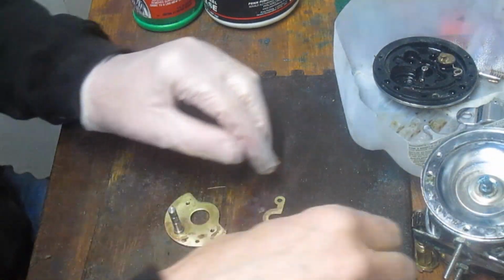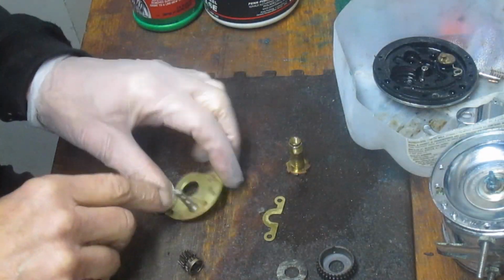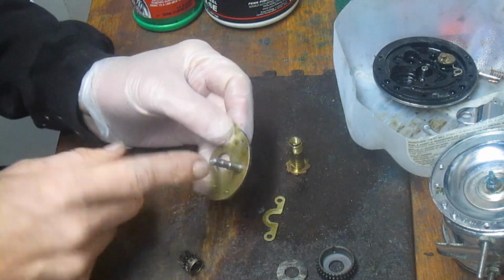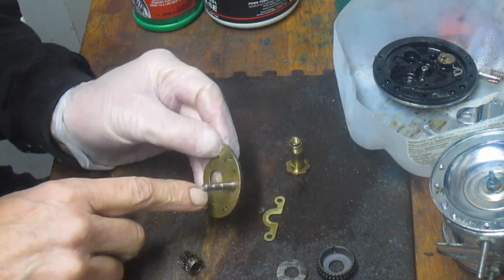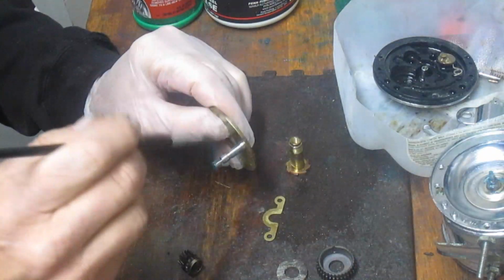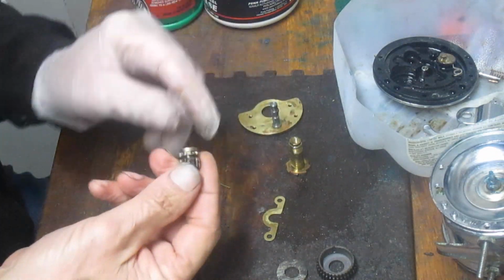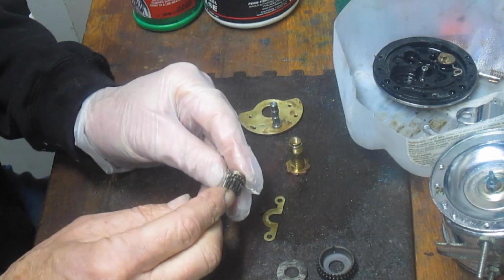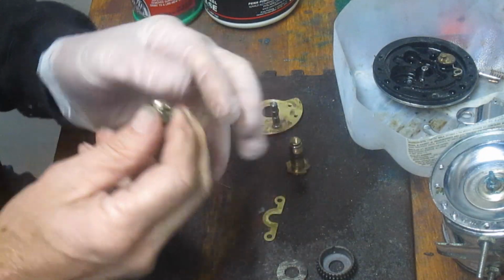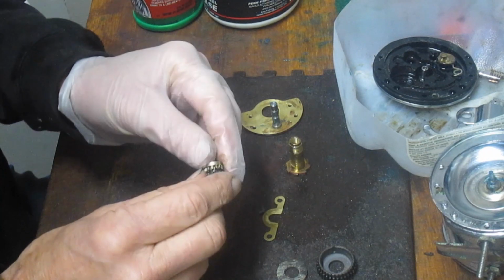So we're going to come over here and we're going to rebuild the side plate. So we took this off, we cleaned it all up with steel wool and chrome polish. Same thing here. I'm going to put a light coating now onto that shaft, and we're going to take a look here. I've already done that, but for your purposes you want to do this. Take a look, make sure all of the teeth are uniform, clean, that there's no debris in the channels.